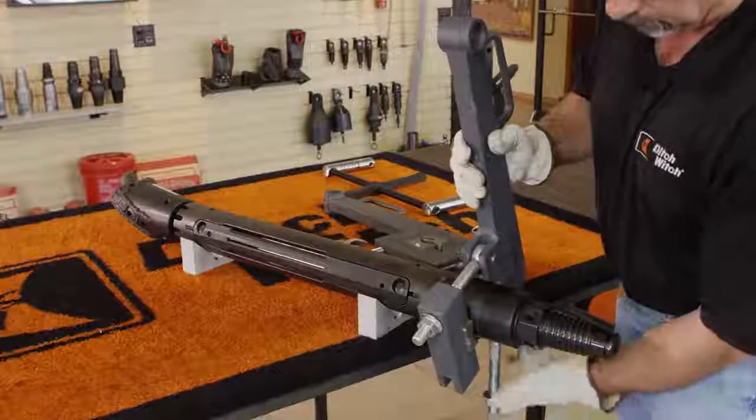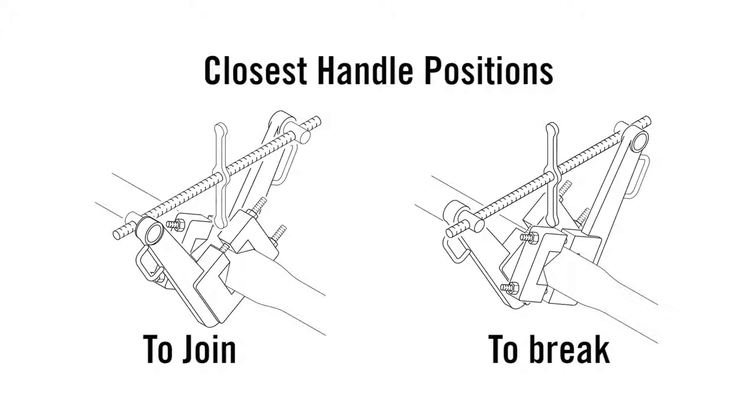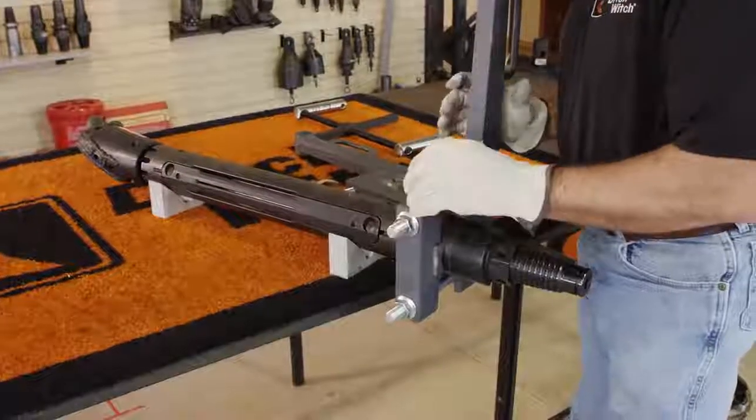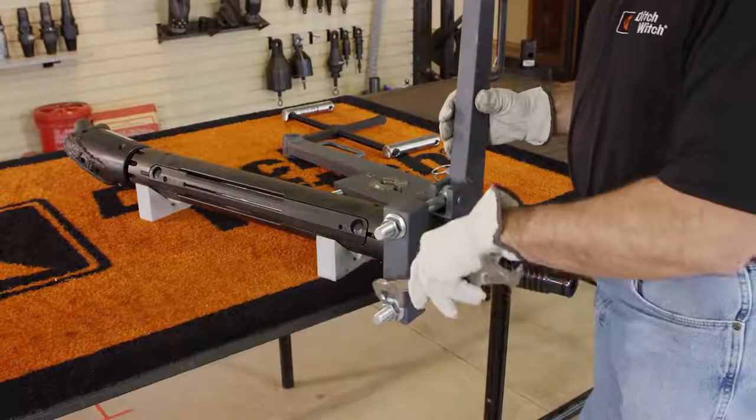Attach quick wrenches to either join or break position. Facing the drill, the handle closest to you points to the left to join and to the right to break out. Unbolt the vise and place the jaws of one handle around the pipe near the joint. Bolt the jaws of the vise together and tighten.